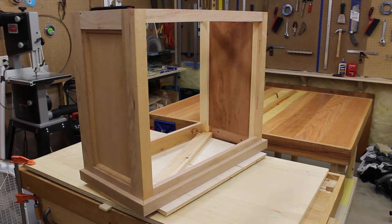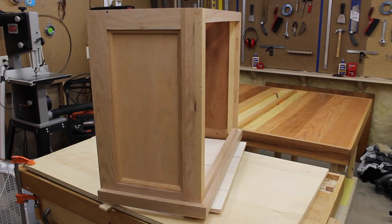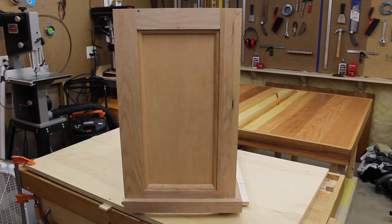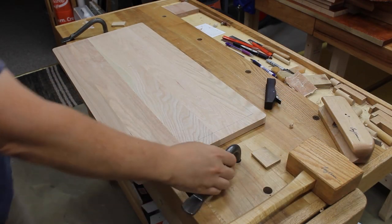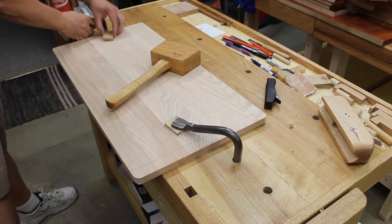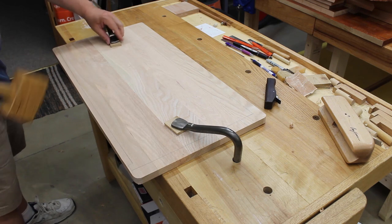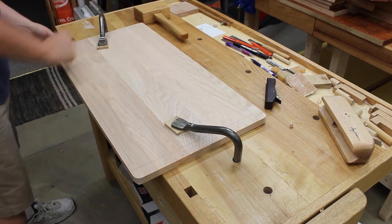So even if you just fire a few pin nails in there. Here's the front — the bottom base put on to the cabinet — you can see almost a 360-degree view of what it looks like. I like that recessed panel. So here's the top: this is a glue-up of the top in red oak, three-quarter inch again. Some of you would prefer to just grab your router and route the edges to a roundover — that's perfectly fine. Again, I'm inside and I want to keep the dust down.